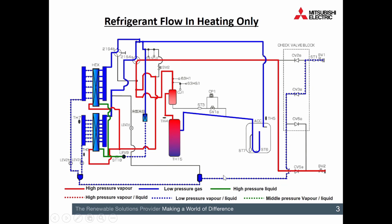It comes into the outdoor unit and up to another gas-liquid separator. This is about improving performance on the outdoor coil because we're going to have a mix of liquid and vapour coming back. There's no point putting vapour through an evaporator — it's already changed form. So we take any vapour off from that gas-liquid separator and bypass the actual coil, giving it more room to make the evaporator more effective. Only liquid is taken to load up that outdoor coil and boil that refrigerant off through the evaporator. The refrigerant then passes through the reversing valves and drops back to the accumulator, which works the same way as in cooling — superheated vapour comes back, vapour is taken off the top, and the accumulator also acts as a way of bringing oil back to the compressor.